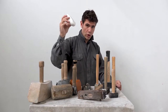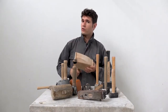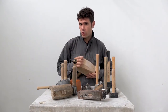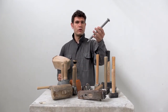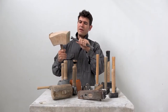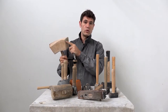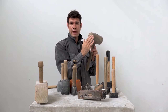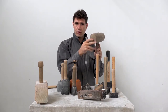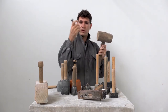Wooden hammers are generally used for woodworking and for softer stone carving — not marble, but alabaster or similarly soft stones. They're also generally used with chisels that have wooden handles, not traditional stone carving chisels made completely out of steel, because while you carve the harder steel shapes the wood. As you can see, this wooden hammer is a little bit deformed on its striking end — there's a depression caused by excessive use with the chisel.